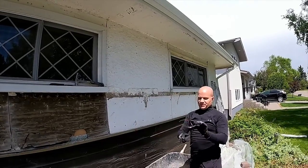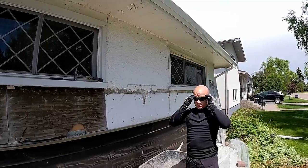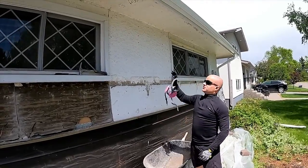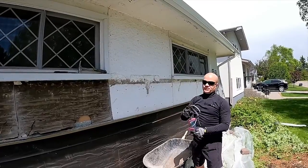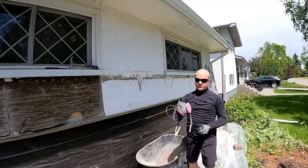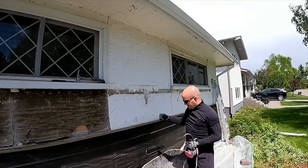These are the first time I'm testing these ones — they have an extra gasket that I'm hoping will keep the chunks out. When you're dealing with concrete, especially when you get up to the top even on a windy day, it's going to be all up in your face. So make sure you have at least a half-mask proper respirator.